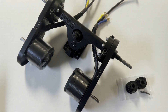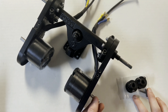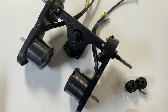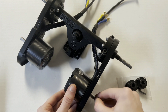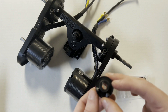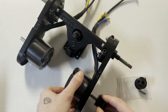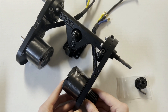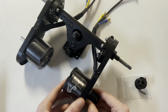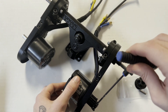Now that our motors are on, we can attach our motor pulleys onto the motor shafts. First you'll want to insert a motor keyway — included with each of our motor pulleys — into the keyway slot of the motor shaft. These just pop right in easily. Then slip the motor pulley on over it, aligning the keyway with the allocated space for the keyway on the pulley. Leave a tiny bit of gap between the motor mount and the motor pulley to avoid any friction. Once you've got a decent gap, secure the motor pulley by tightening the socket cap bolts. Repeat this for the other motor.